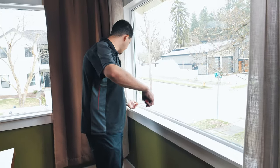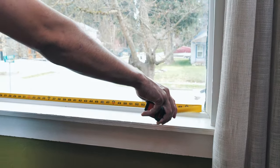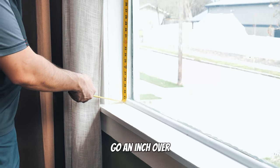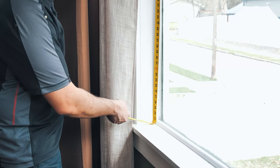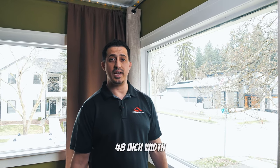First things first, let's get our windows measured. Get the width — you want to go straight to the edge of the glass. We've got 63 inches exactly. Now we're going to measure the height and that measures 41 inches. Good practice is to always go an inch over, so we're going to cut a 42-inch height by 64-inch width. You have a couple of options: you can go with a 72-inch width material or a 48-inch width material. Keep in mind you're going to need a total of 5 feet with the 72-inch, or a total of 10 feet if you order the 48-inch.